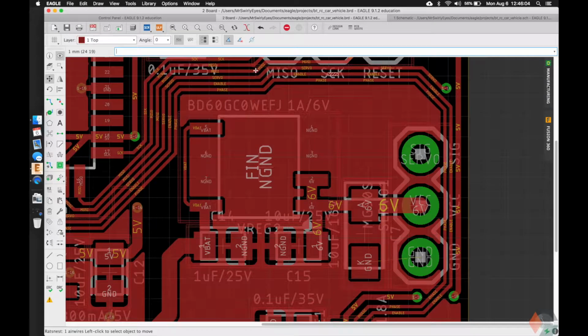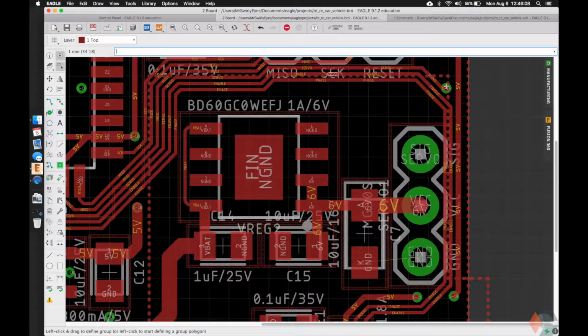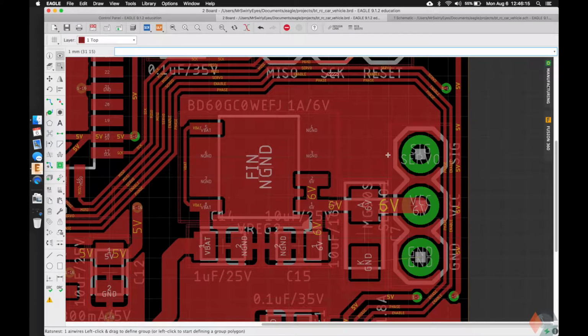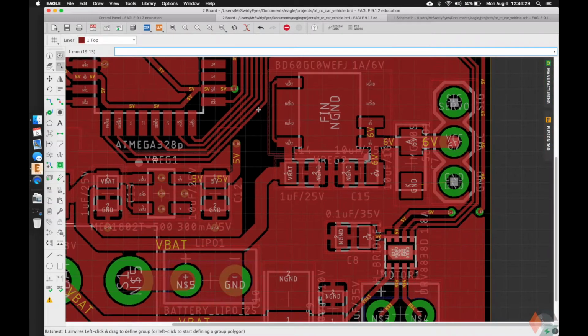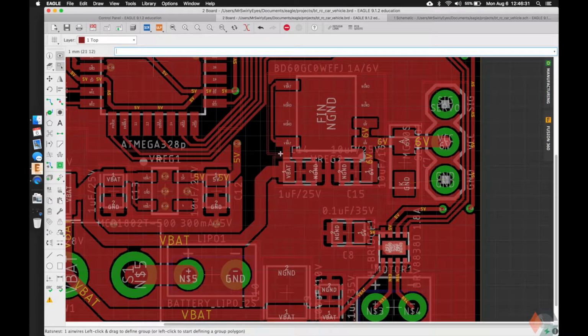So it may look kind of weird that I'm covering the routes we have, but when it does the fill, it'll only do where it can be connected. So there, nice and continuous, or at least as continuous as we can make it. The capacitors here, it may look weird that it's kind of disturbing it, but it's actually nice that we'll force the signal through here and immediately join the noisy ground. We can actually reduce our noisy ground, maybe push it over a bit, and let our regular ground have this, because all this is continuous with that.